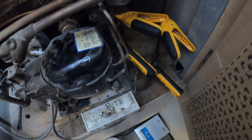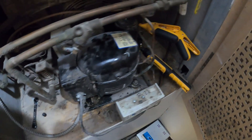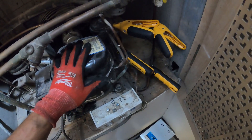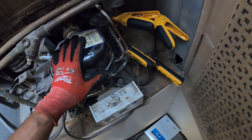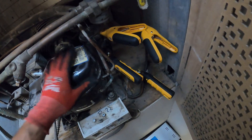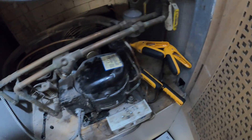For this one, there is a large leak as there's barely any refrigerant in the system. So we're going to come here to remove and recover the rest of the refrigerant, charge it up with nitrogen, pressurize it, search and repair that leak, and then get this back up and going.